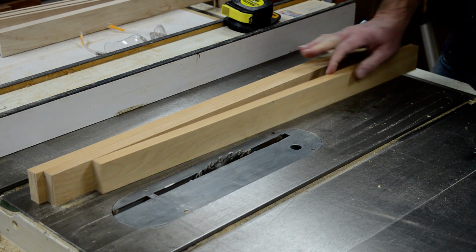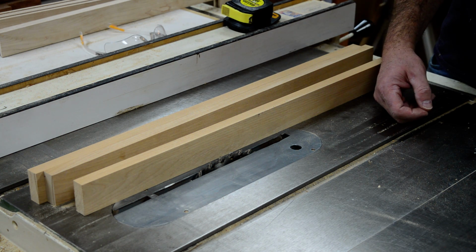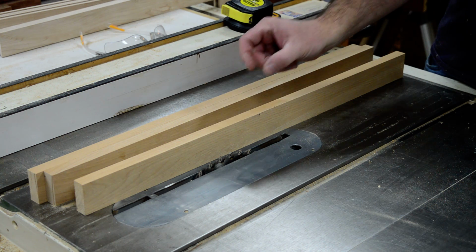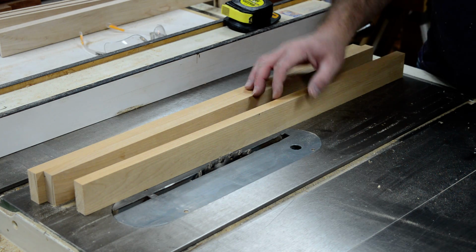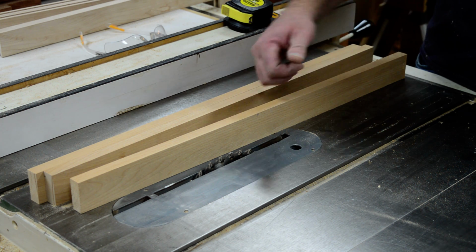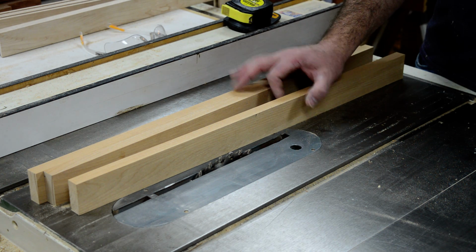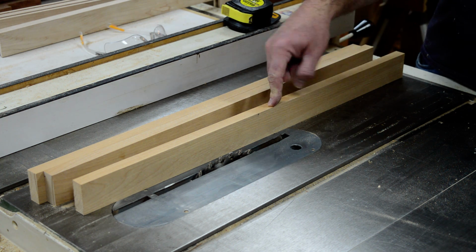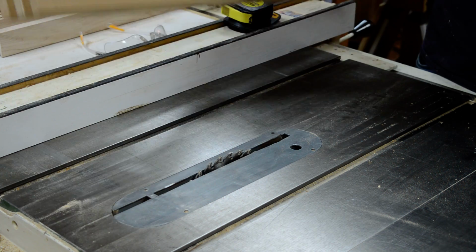The other thing I should say about this, I want this material for most size doors for furniture making to be about 3/4 of an inch of thickness. If it's a little bit greater than that, that's fine, but you start running into problems if the thickness is greater than 3/4 if it's a smaller door size. We'll talk about that when we get into the fitting, but it ultimately is going to cause the opposite corner from where the hinges are, the inside corner, to bind or hit against the carcass. So 3/4 of an inch will provide enough material for mounting hinges, as well as the stability to create for a panel size. If it's less than that, it should be a much smaller door.